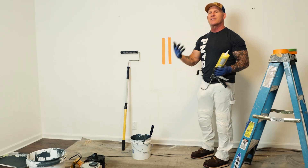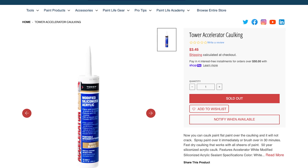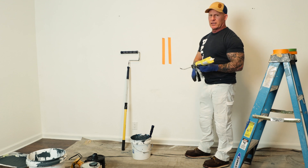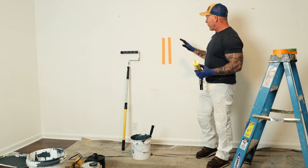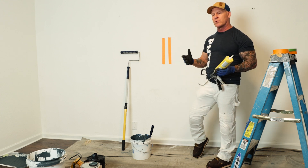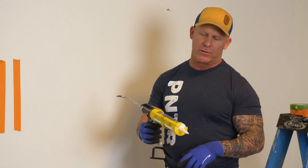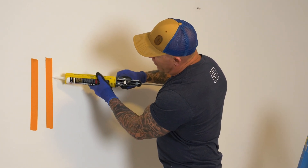Tower makes a caulking called Accelerator that's specifically made so you can caulk onto a surface and then paint over it immediately — you don't have to wait for it to dry. I use Tower Tech 2, which is a little bit different than Accelerator; it does say you have to wait for the caulking to dry. But we've been using this method for about 20 years and we've never had an issue with it, as long as we're using any type of paint that has a sheen to it. If you're using a flat paint, the paint might crack a little bit. Tower Tech 2 clear caulking is really thin — we're just going to leave a really thin bead of caulking down and wipe it off.